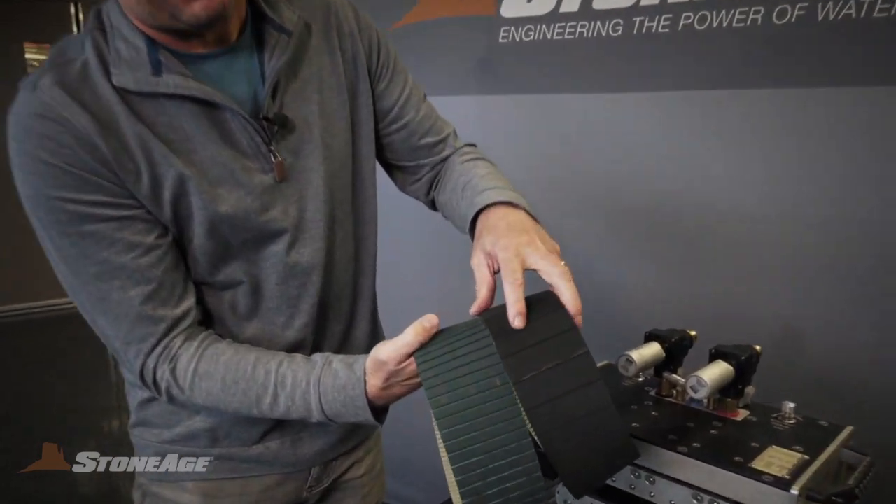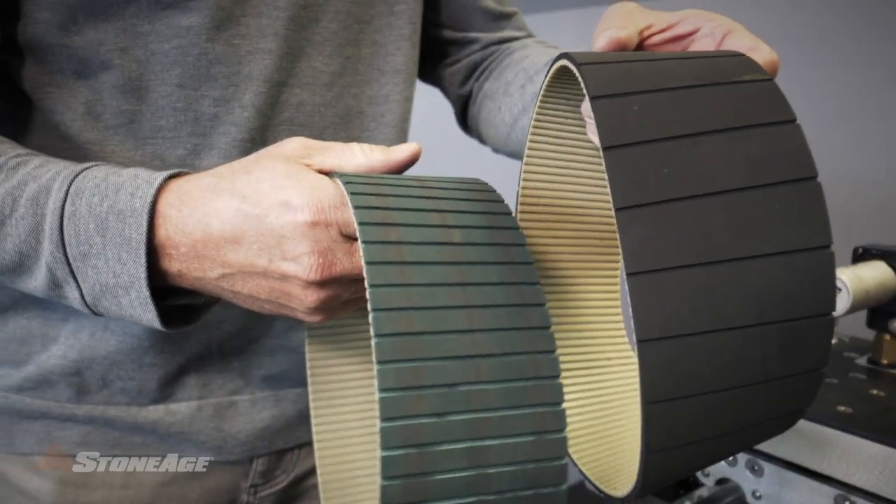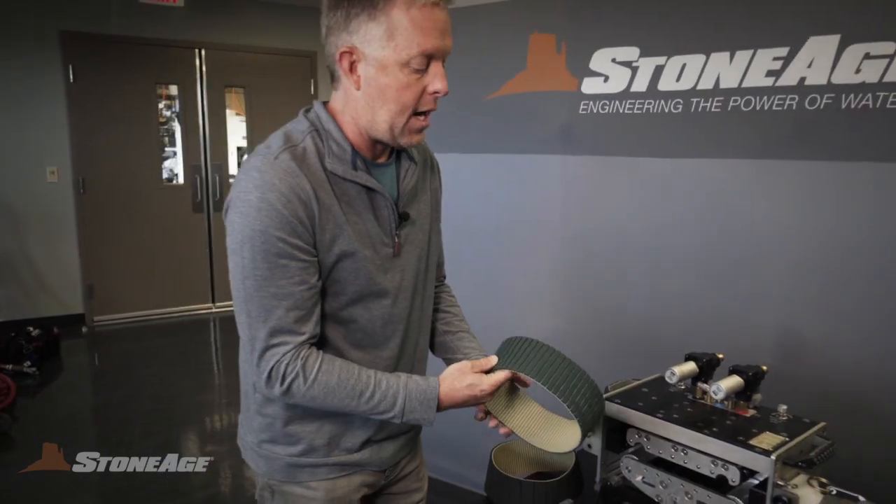The difference is, you can see the grooves between the belts are different, and also the durometer and the materials are different. So we have one belt for really oily, slippery conditions and our standard belt, which comes new on every AutoBox tractor.